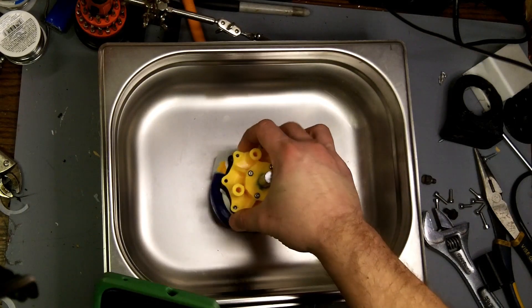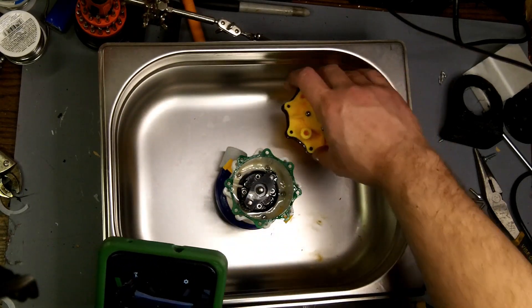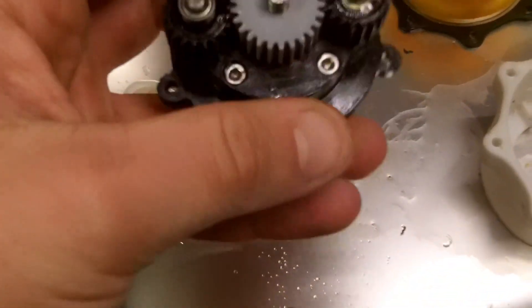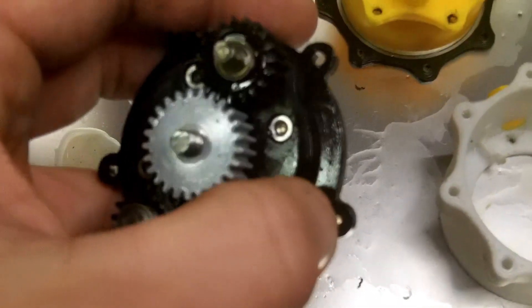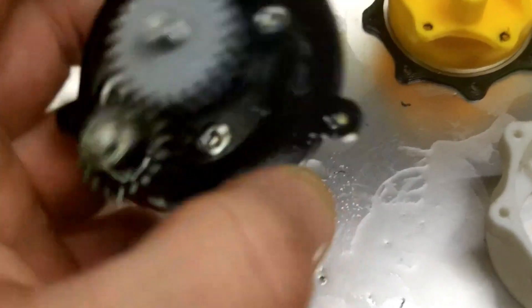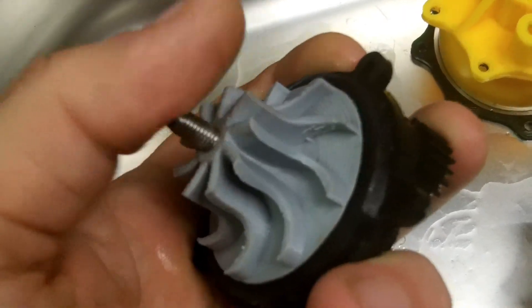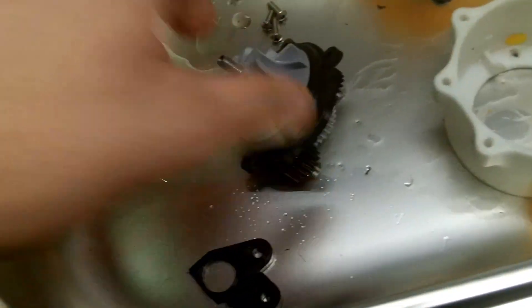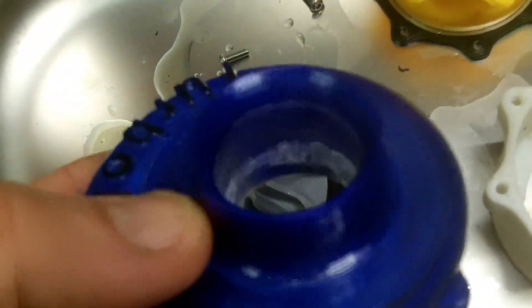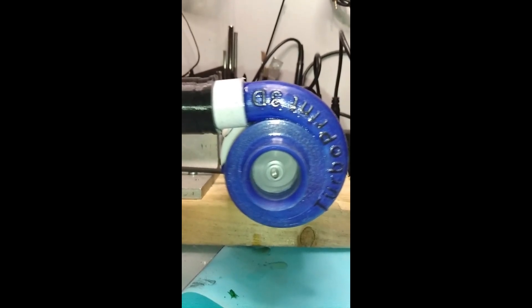As I pull it apart, the input drive seems to still be alright, which is a good sign — I don't see much if any wear on the teeth at all. Once I got mostly everything apart I noticed a couple of problems: the backing plate seemed to have loosened itself, and the nut clamping the final drive gear onto the shaft came loose. The bearings are shot — they were nowhere near that loose when I installed them. Overall there's no actual catastrophic damage; the impeller had ended up rubbing on the housing and welded itself together, and then everything else let go from there. For improvement I should use better bearings, maybe heat-stake nuts, and some Loctite to keep it all together under that kind of RPM and vibration.